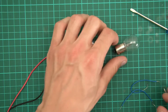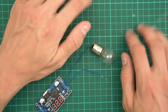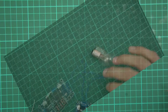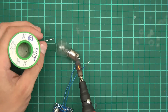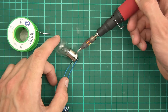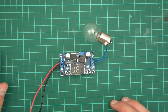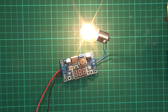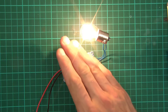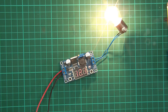Well, I don't know — I'll keep trying. I've got this bulb and it's 1.85 amps under 12 volts. It looks like I might have to solder it. Alright, it's attached now. Let's see if I can get this to hover. Oh, there you go — that's handy. You can't actually see it, but it does say 12 volts — 12.1. That should be 1.85 amps. Now, I know there's quite a lot of heat coming off that already. Let's put it over there. Now what I want to do is measure the temperature of the chip — if it's getting ridiculous, I'll have to turn it off.